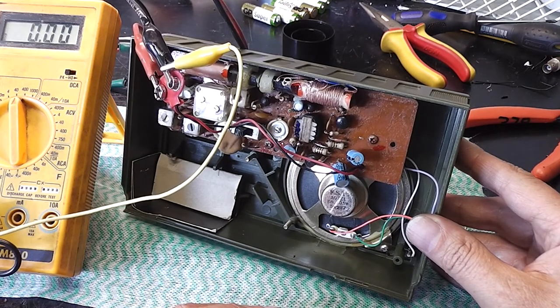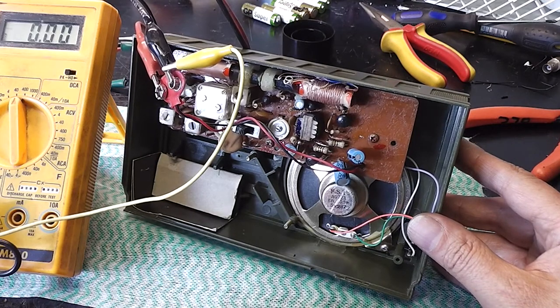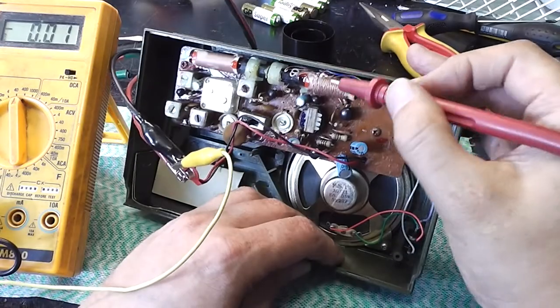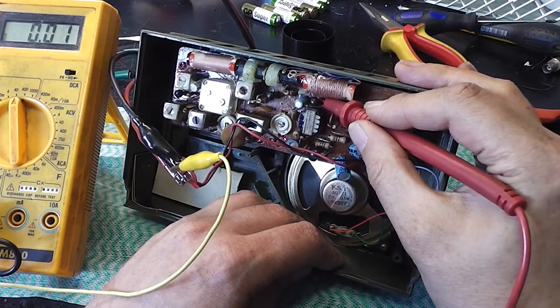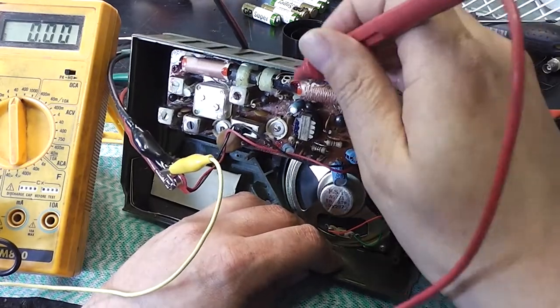I suppose I'm going to need to sit the circuit board out and perhaps work back the other way now. Maybe the driver transistor's gone wrong. It's entirely possible. Question is, could even be an electrolytic, I guess. Can I get at the pins? 5. What are we getting? This does not look easy to probe.